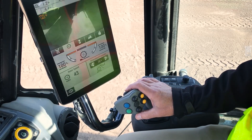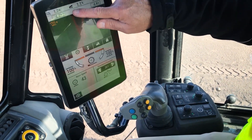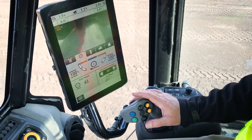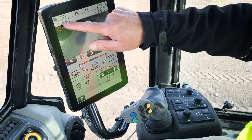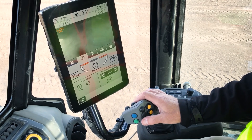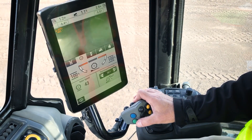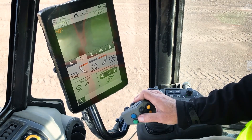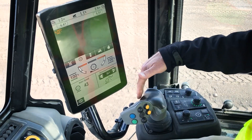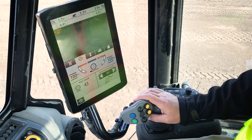To apply pressure to that rear door, these colored buttons on the front are the exit cut and return to cut features. When the operator has the machine working at the desired depth, two taps of the green button will save that depth, signified by the square box around the rotor depth. When the operator reaches the end of the cut, one touch of the blue exit cut button will raise the rotor so that the operator can close the doors and fill the hole made at the end of the cut.